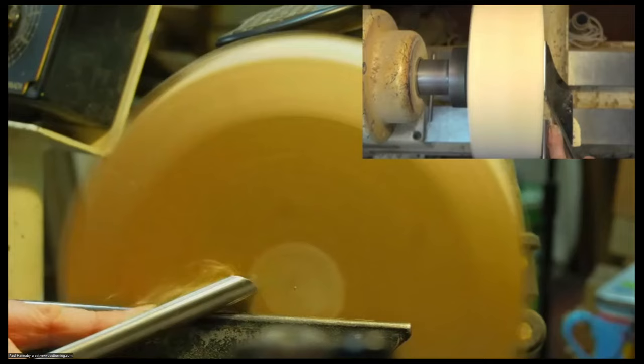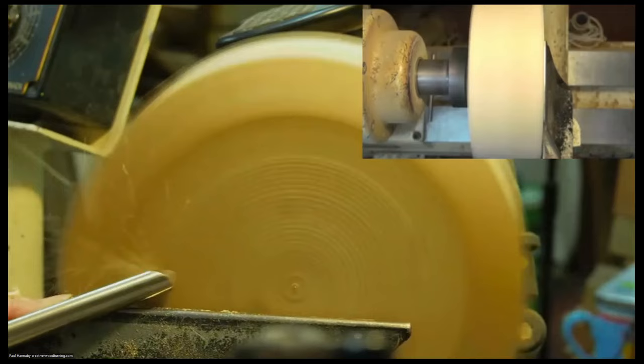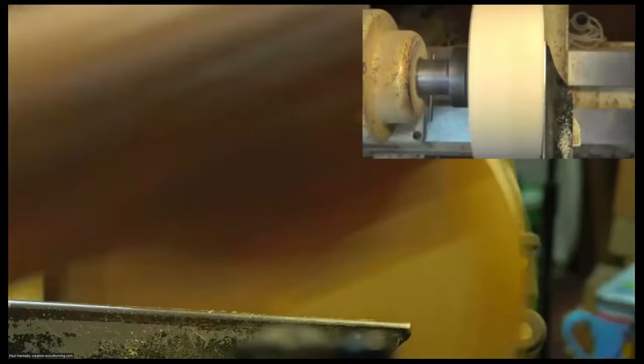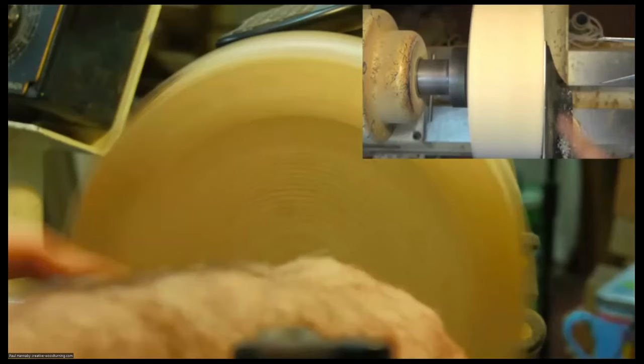The left wing is hitting the center line so if I've got my rest set correctly I can cut right on center and then pull backwards — you can actually cut backwards and forwards with this. All I'm trying to do is flatten off the face of the blank. I haven't gone all the way to the edge, but I'm all for being efficient — I've just flattened the bit in the middle, which is where I'm going to make my chuck spigot. The bit on the outside doesn't matter since I'm going to turn that away. I'll use dividers to mark the spigot.